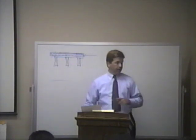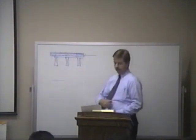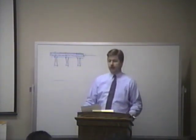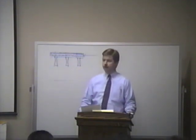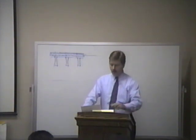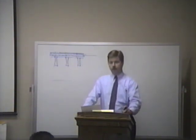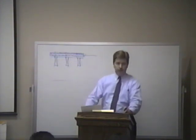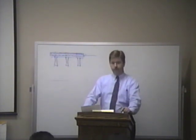Your solar gray, such as this one out here, if I'm not mistaken. Yeah, solar gray, solar cool gray. You have solar bronze, and they come with these terms to make it sound like it's solar. Sounds kind of nice, but solar cool gray, solar warm gray and solar bronze are the cheapest glasses on the commercial market. They're tinted gray or bronze, and they're not very efficient. They have a very poor reflectance coefficient.